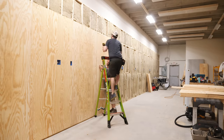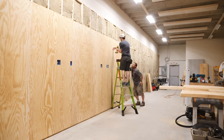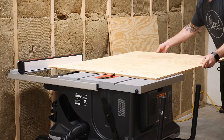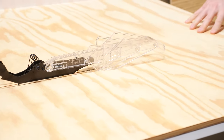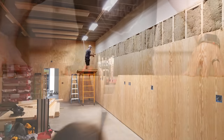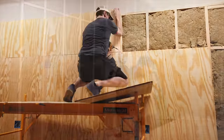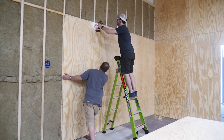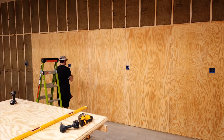We just kept repeating this process down the wall, stopping at the metalworking section where we used fiber cement board as the wall covering. To fill in the second row, I used the offcuts from the top row of the partition wall and crosscut these to width using my table saw, though a circular saw or track saw would have worked fine. The top row went extremely quickly, and with that done, we moved on to the right side of the shop. The process on this wall was pretty much the same, with the only difference being that this wall is 12 feet tall versus 10 feet on the other wall, so we could just crosscut the sheets of plywood in half to fill in the top row.